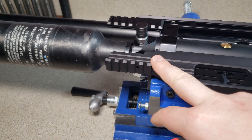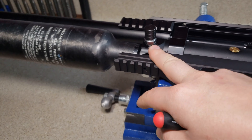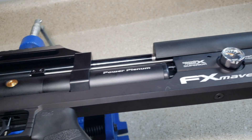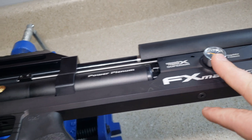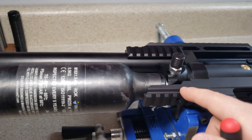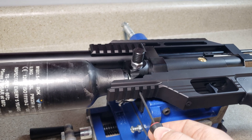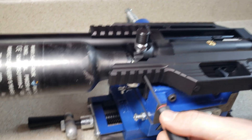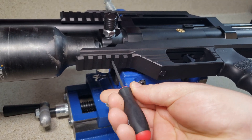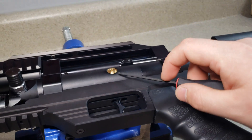For the sake of this video, I'm going to take the first regulator down to 150 and the second regulator down to about 110. So first is 150 and second will read 110. We do this by turning the screw clockwise to decrease the pressure — I'll stick a 2.5mm Allen in there and turn it clockwise a few turns so I know the pressure has been decreased. I'm not going to touch the second one yet.